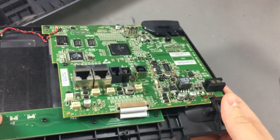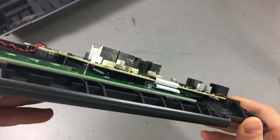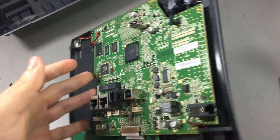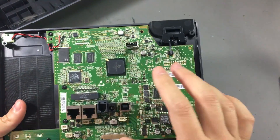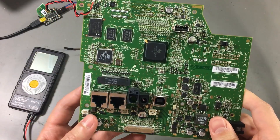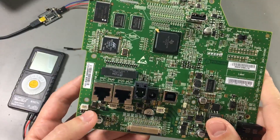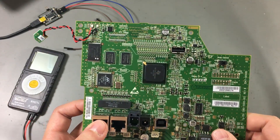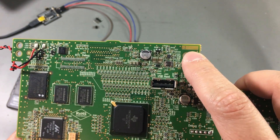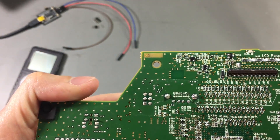It looks like it's a two-board construction — one board for holding the keypad and probably the LCD as well, and another board which is the main board. I've taken a closer look at the board and even probed a UART port. First, this is a six-layer board, and how do I know that? They've included a layer count indicator, and if we look closer on the back, we can see it counts up to six.